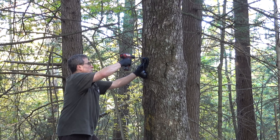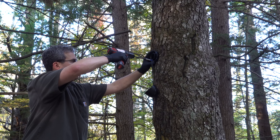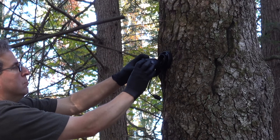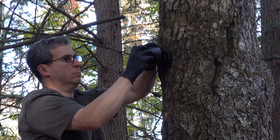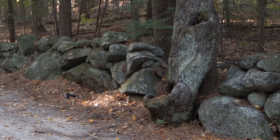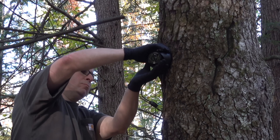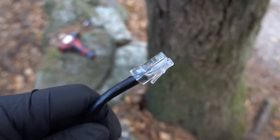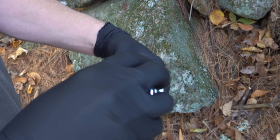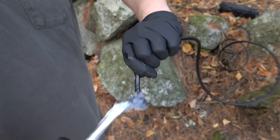Next I need to mount the camera on the tree. When you're doing work like this, it's kind of unusual — this is not normal networking. In my experience, if you're going to put a screw or a nail into a tree, it's best to use the shortest screw possible and as few as possible. This tree already has some giant holes in the bottom but it's been around a long time. I'll just use the stainless screws that come with this bracket and put two of them in — that'll be firm enough for the tree mounting. The Ubiquiti's got its own O-rings and is probably fine, but I'm still going to add some dielectric grease to completely waterproof the connector.